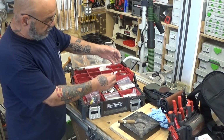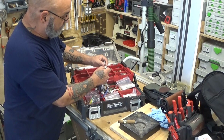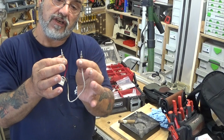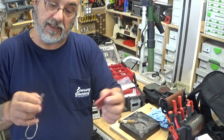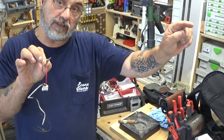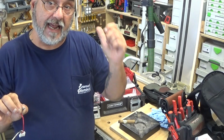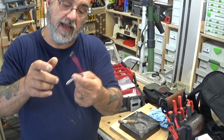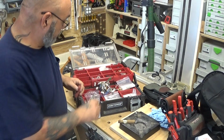I carry temperature sensors. I carry thermistors, which are this little thing right here. This is also very important to have extra. I carry a little piece of Scotch-Brite, and I use it for 2 reasons. Clean off the thermistor. Once you pull it out, there's a tiny little O-ring. It most likely will be inside the heat exchanger. Make sure you don't lose it, but I'll show you the O-rings that I carry. Clean this off, reinsert it, put the clip back on, put the screw in. That could be one of your problems, but very important, a little piece of Scotch-Brite.